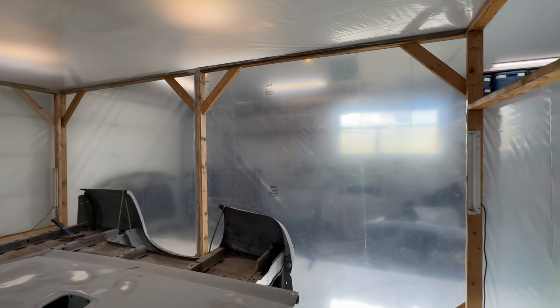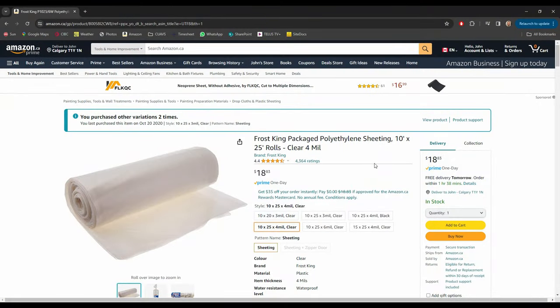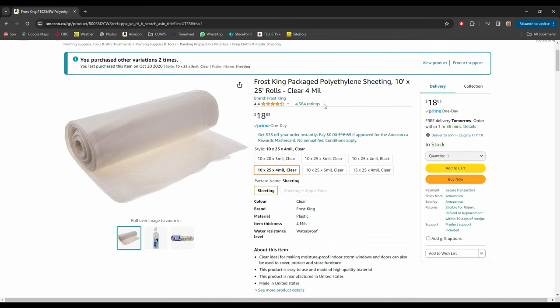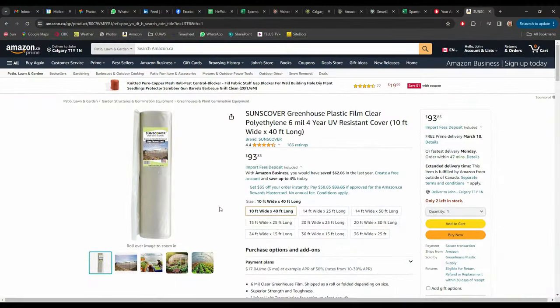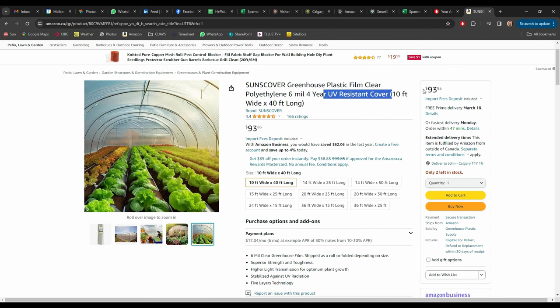So it's here — it's technically being reused. A few things to address: the plastic I sourced last time was not UV-safe, and even though the panels were stored out of direct sun, I think a lot of reflected sun got to them. Combined with a little wind, they just disintegrated — turned to dust when you touched them. I've rebuilt it now with four-year UV-safe six-mil poly. Before I was running four-mil on the sides and six on the top; now I'm running six all around. If you're doing this for the first time and want it to be reusable, buy the UV-safe stuff — that's a given.